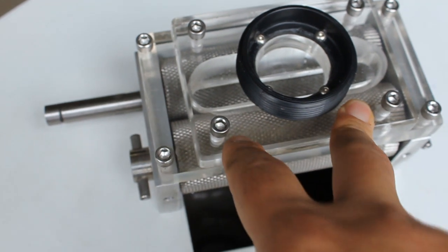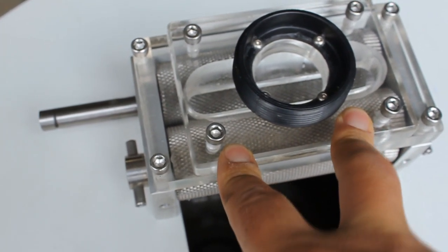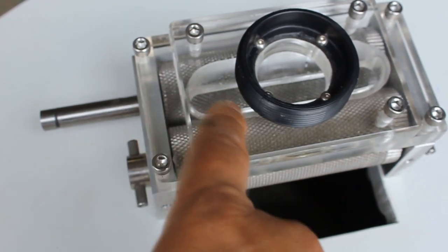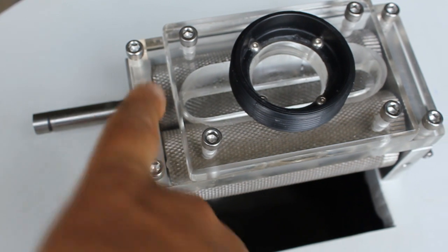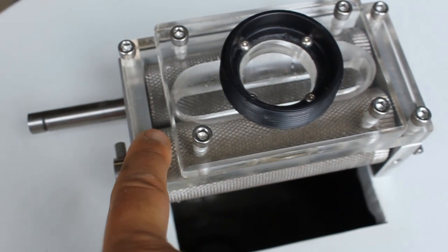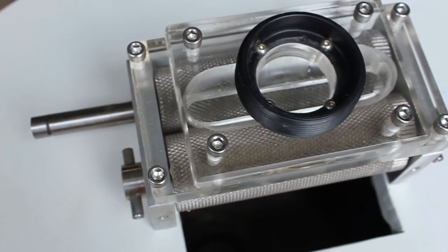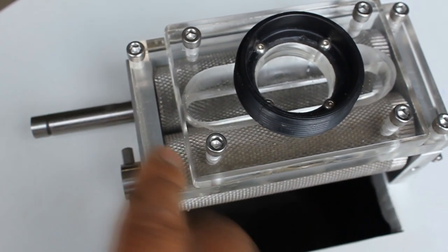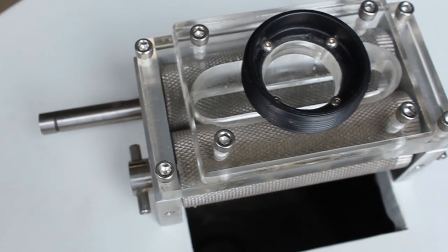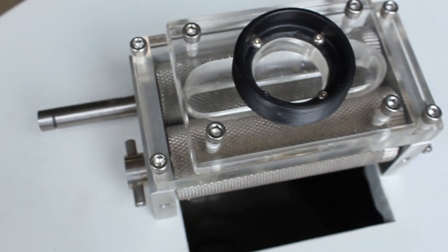That's sort of one of the constraints of trying to build your own hopper for one of these bare bones mills, is that you really can't just dump grain in the entire top cavity of the mill, because you want it to be falling in sort of like a ribbon in between those rollers. You can get a mess going if you fill up that entire top cavity while the mill is spinning.